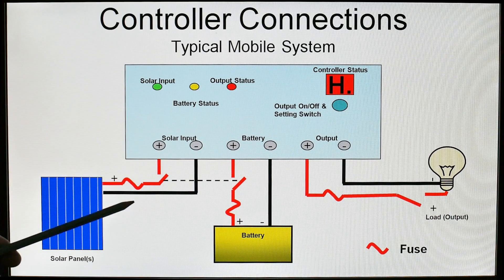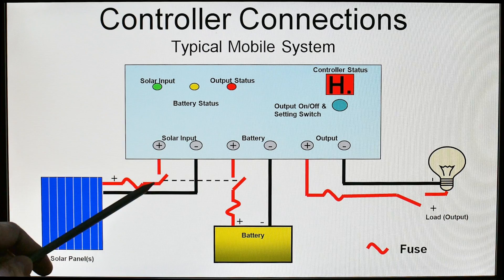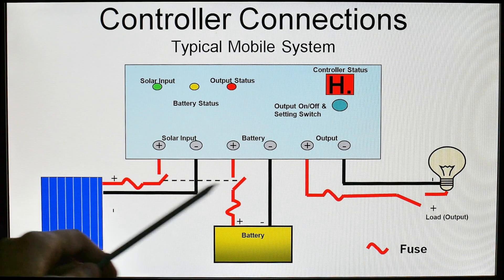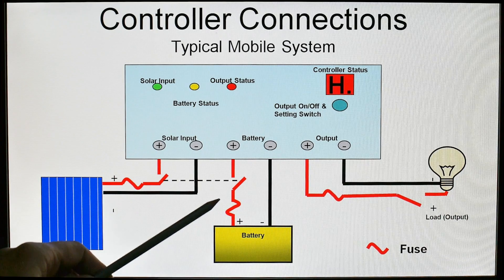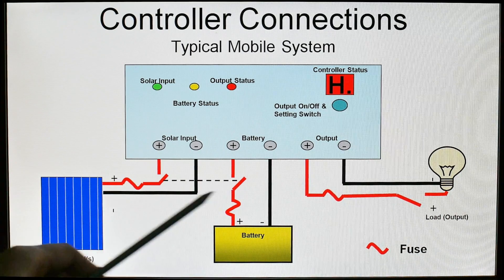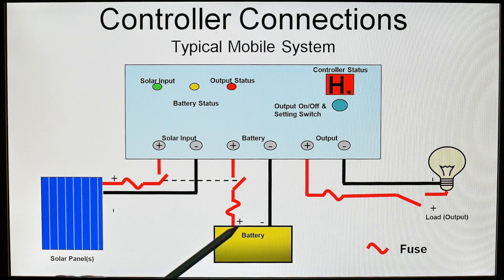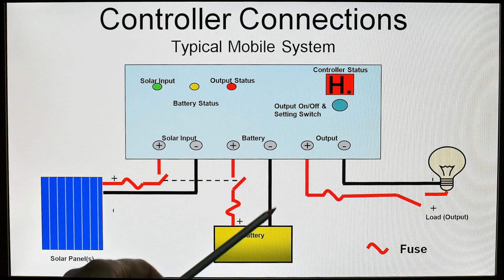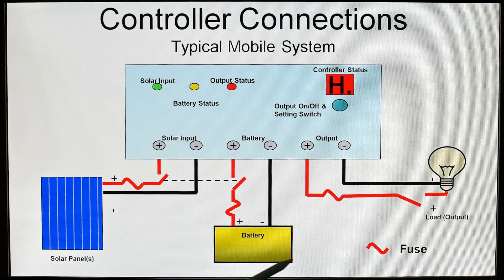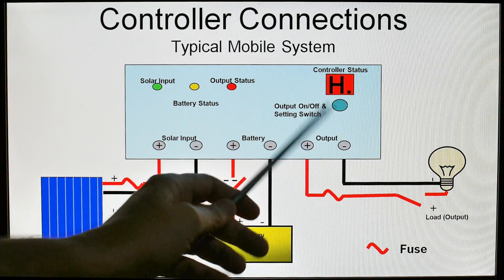Here are the connections. We have the solar input plus and minus — the solar panel with the plus going through a fuse and a switch. I have the switch that connects and disconnects the battery and the solar panel tied together, because if you shut off one but not both at the same time, some controllers will do some pretty weird stuff. So I switch mine off together. Then there are the connections to the controller, then the battery — again with a fuse and switch — and then the negative lead. Then the load with its own switch and fuse and negative lead. This is also where the on/off switch on most controllers comes in — if the controller has one, you may not need a separate switch.